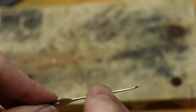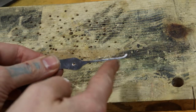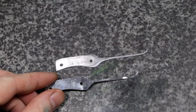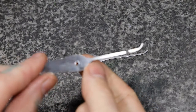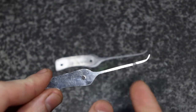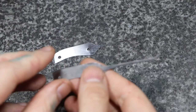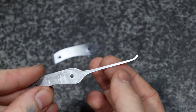And we are going to sand the top and the bottom with actual sandpaper as well before we buff it. Two things to watch out for when you're grinding down your pick and you're sanding it is watch for the thickness here. So always be careful of your profile there. See how this one's got way too thin at the bottom here. I don't trust the life of this one. I'll throw in another cheap handle. And this one as well, I'll throw this in a cheap handle, but it's a perfect profile.